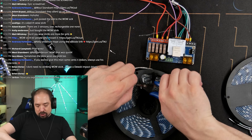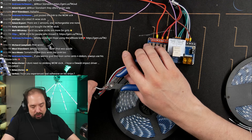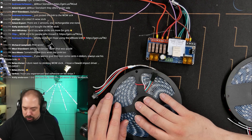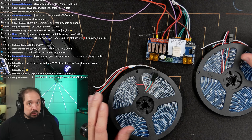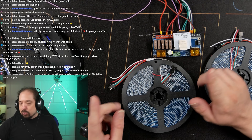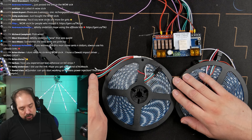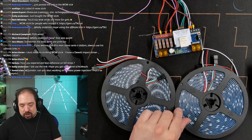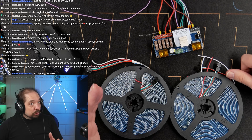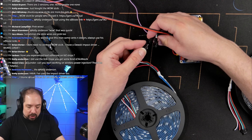This stream isn't going to do perfect power injection — we're just hooking them up using a standard JST connector. That's okay-ish for 5-meter 300-LED strips, depending on what you do with them. If you want to drive them at high output levels, you should inject 5V at the front and at the back. For 10 meters in a single string, you'd inject at the front, middle, and back — every 5 meters. I chose these strips because they're all different, to show various scenarios and how to configure them in WLED.